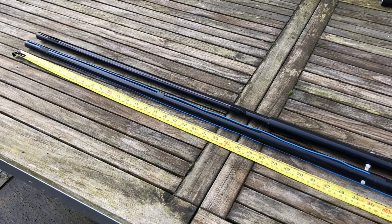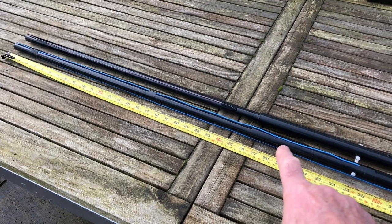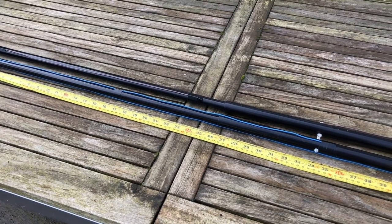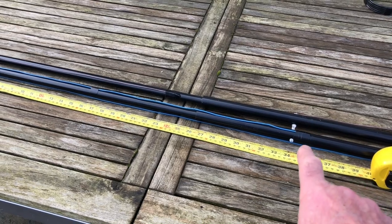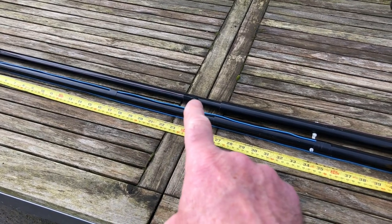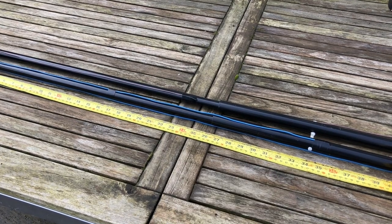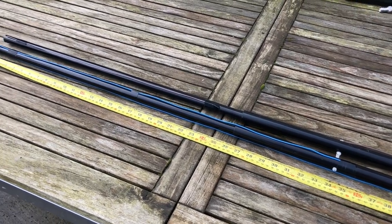And in terms of the wires, and again I'll summarize these at the end, but for 10 meters the reflector is 554 centimeters long, and the fold back is 90 on both sides, and the director is 486 centimeters long, and the fold back is 56 centimeters. I'll give the CB measurements in the table at the end, but they're the two main elements.